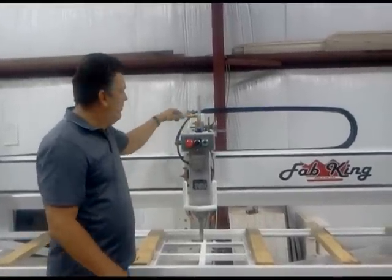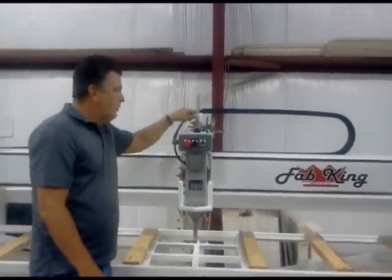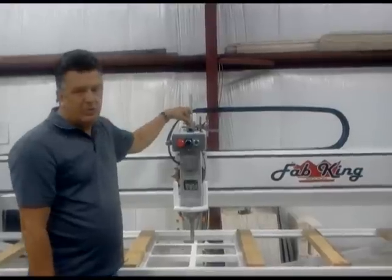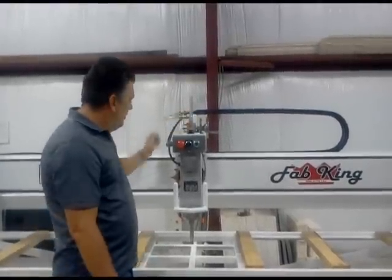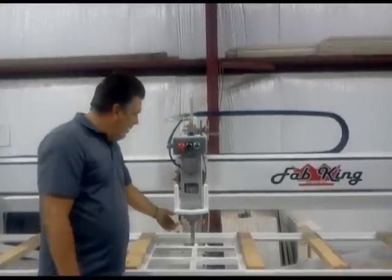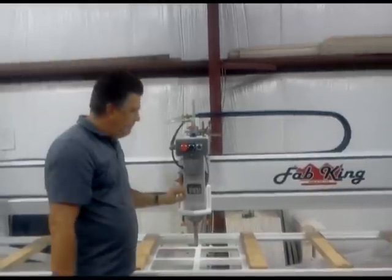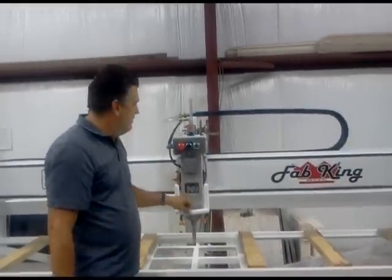Water control, 2 types of water, through the shaft water and halo water. Most tooling comes with through the shaft, which is necessary to keep the diamonds cool. Some tooling does not have through the shaft water, and you'll need halo water. I also use halo water when I cut a sink out to keep water in the bowl. That helps cut down on splash.